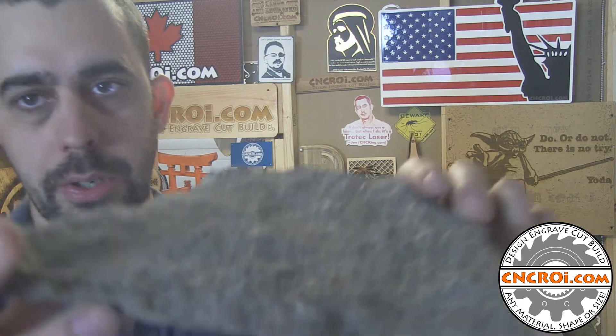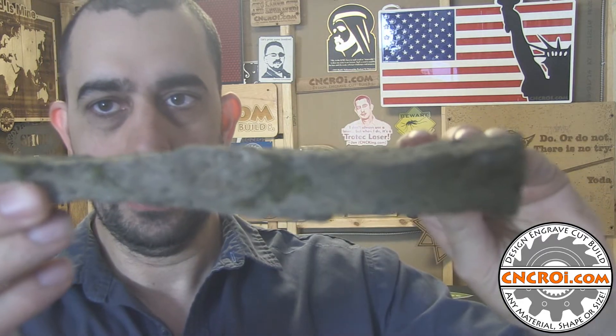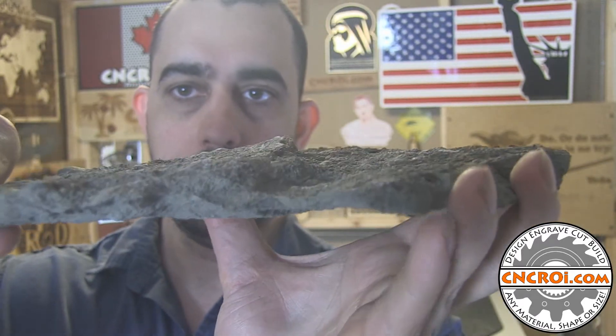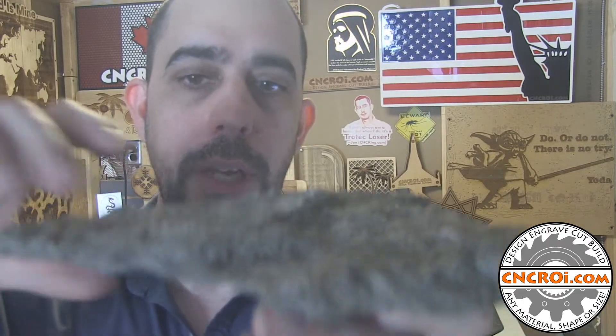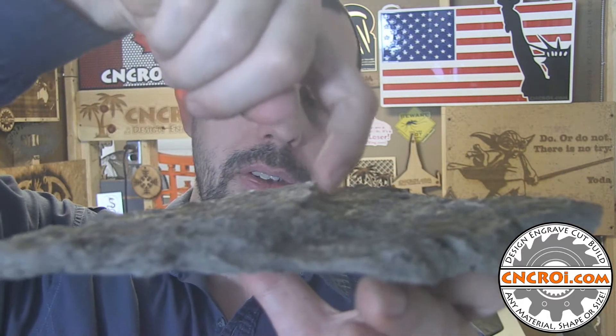Let's take a good look at a random stone I picked up in the field behind the shop. This stone is really rough on one side but relatively flat on the other — the flat side would be a very good surface to engrave on. The rough side has some different heights, so maybe you'd need one or two passes to get the right result in one area, but five or six passes in another. When you have angled surfaces like this, there's no way for the laser to be totally in focus, and you'll get a little bit of blurring.